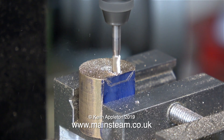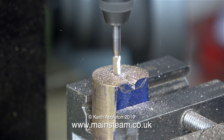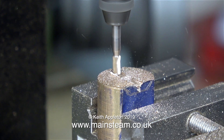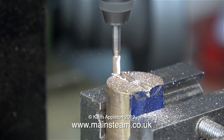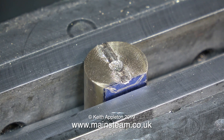Using the EF70 for milling the slot down into the crosshead using a cutter like this one was quite a good idea, although it did seem to take quite a long time. I showed it in the last video and the milling footage was very heavily edited because it took a long time to mill that slot, and when I started to rush the job I broke one of the cutters.